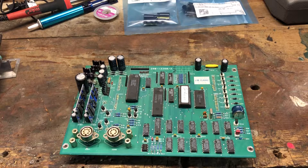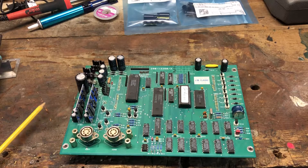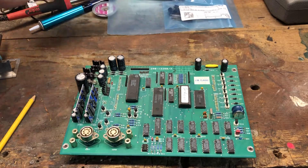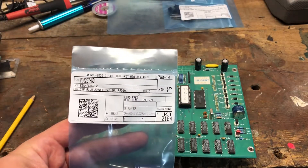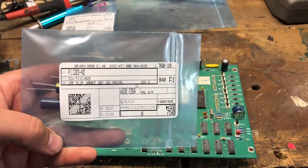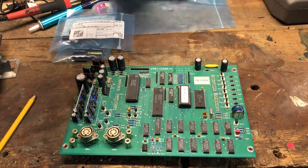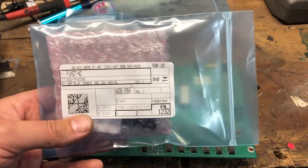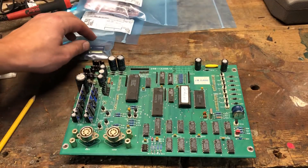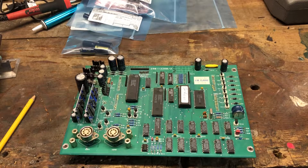The unit was built in '96 according to the inspection tag, so it's about 25 years old. These electrolytic capacitors could be the culprit. So let's start changing those and see what happens. I ordered some replacements online from Digikey in a couple of different sizes. Digikey is nice because you can search not only by value but also by physical size and lead spacing of the components, so you make sure you've got an exact fit. We'll change those out and see what happens.